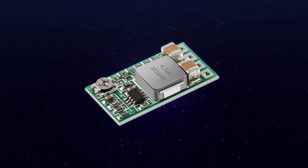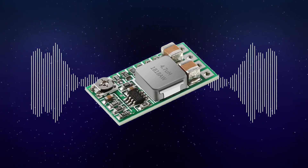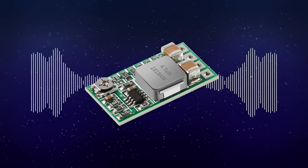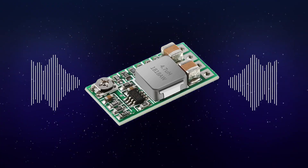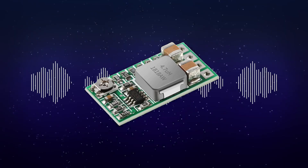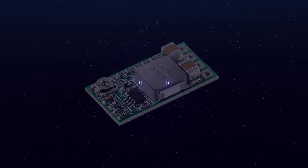I also bought a couple of voltage regulators — they are 5-volt, 3-amp power regulators. The motor controller actually has a 5-volt regulator on it, so when you attach the power source to the motor controller you have 5 volts there. Unfortunately it's not powerful enough to supply both the computer and the Wi-Fi.